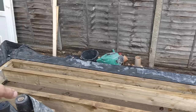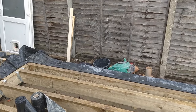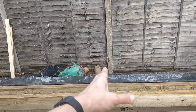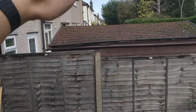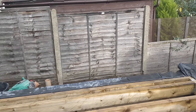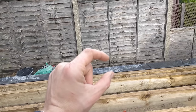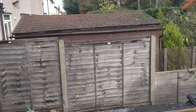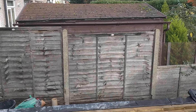So what we're going to start by doing is working out the exact height of the wall along this wall here. We have a sole plate which is a timber on its side, studs coming up, and then a double header plate. The top height is going to be 2.4 meters. Working backwards: we have 50mm depth timbers, so that's 50mm at the bottom and 100mm at the top for the double header — 150mm total — taken off 2400.